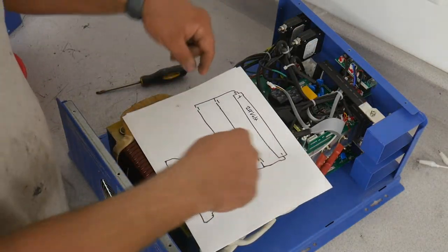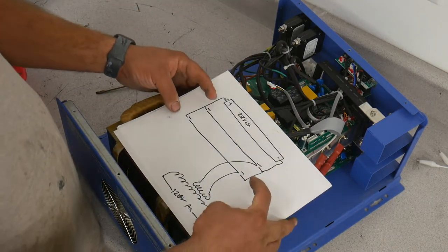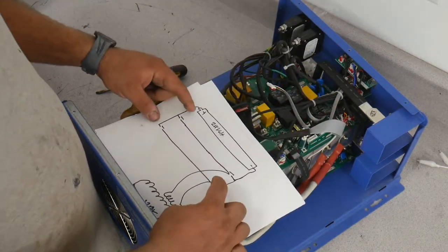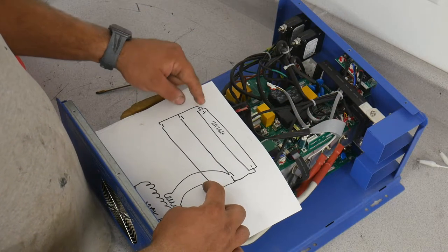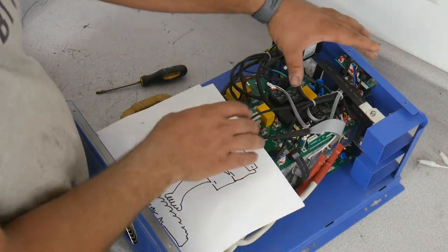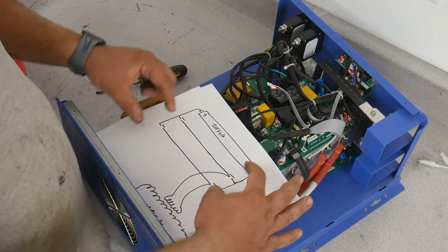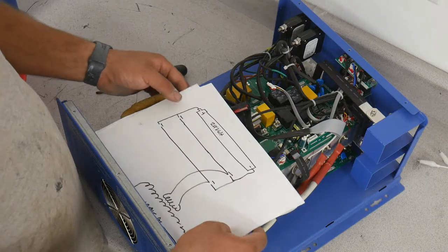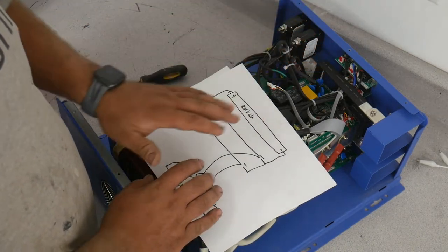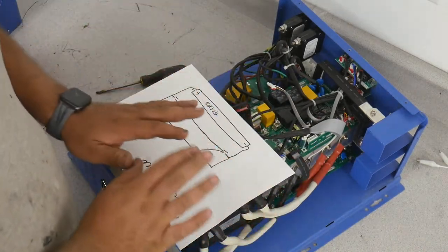These would be manual push button switches. So what this thing is doing is basically turning on these eight and these eight FETs, and it clicks these switches down so that the positive goes through this way, the negative goes through this way, and then it alternates them. Click, click, click, click. That's the basic form of where the DC to AC is generated here. Now it gets more complicated than that. We're going to get back to that in just a minute.